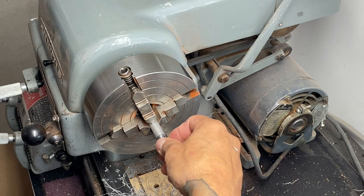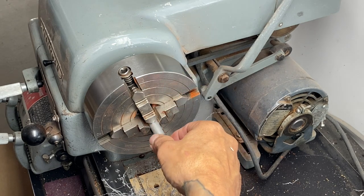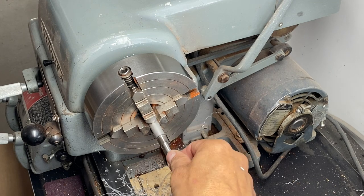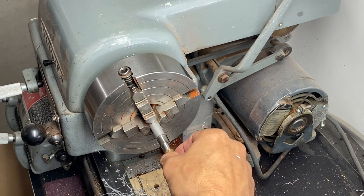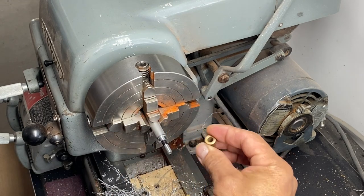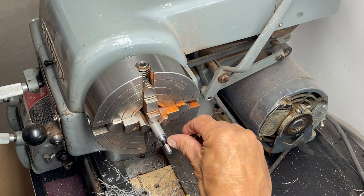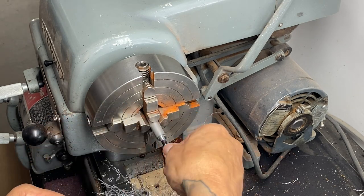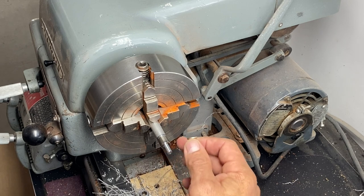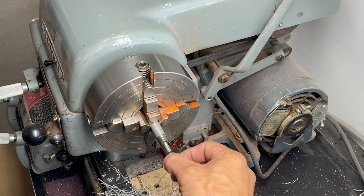I may have gone a little much but it's going to get epoxied in place. It's attracted to the chuck that last bit of distance. I need to cut it slightly down here at the end for this bronze insert — both this magnet and bronze bushing ID is 0.25, quarter inch. I put a little bit of a step there and made this part just slightly, a few thousandths under, so it'll engage easier. Then I'll chamfer it and put a countersink on this so it'll engage easier.